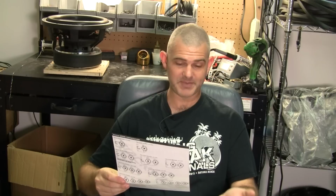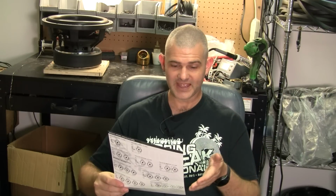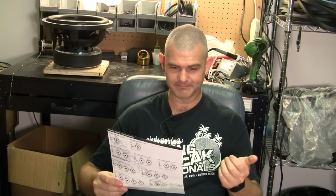Your QES shouldn't really change, and they have it listed here as 0.424 and 0.383. Your MMS, which is your moving mass, 355 grams and 337 grams. You didn't change the sub. You didn't change any mass, so you shouldn't get a different mass number. Like I said, from test to test, it should be reasonably close, and maybe that's out of tolerance on the test machine, but it shouldn't change. The dB SPL, that's going to be your efficiency, 85.3, 85.7. I can see that being a variance in testing. Your SD, which is your piston area, listed as the same. I have not checked to verify that that is accurate, but we can.